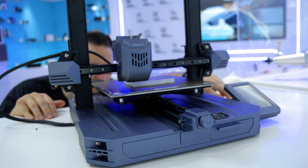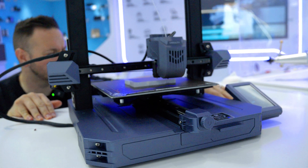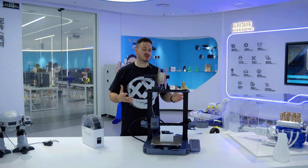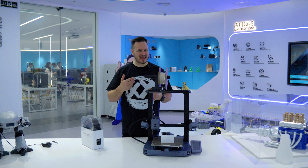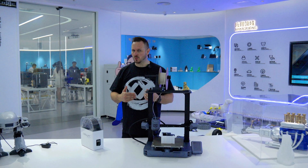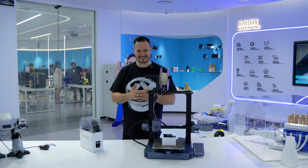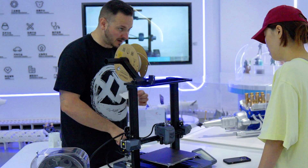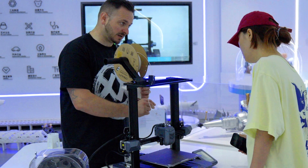Then I noticed something I really wasn't happy with and I called a stop to the production. While we have two floors of R&D in this building, we decided to call in the experts. The first resonance test is now done. I'm curious to find out why it's only the X axis that does the test and not the Y on the bed. We'll try to speak to an engineer before I leave to find out exactly why that is the case. I was expecting an accelerometer in the bed — either in the motor or elsewhere — to get that second data point.